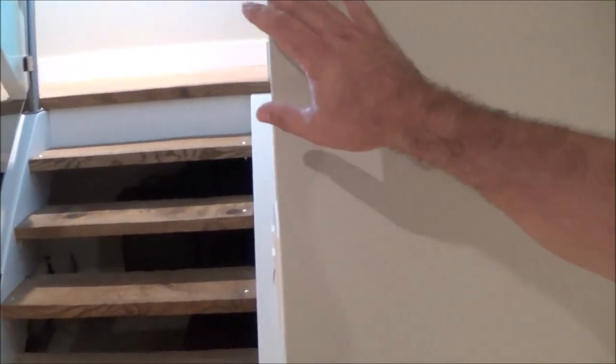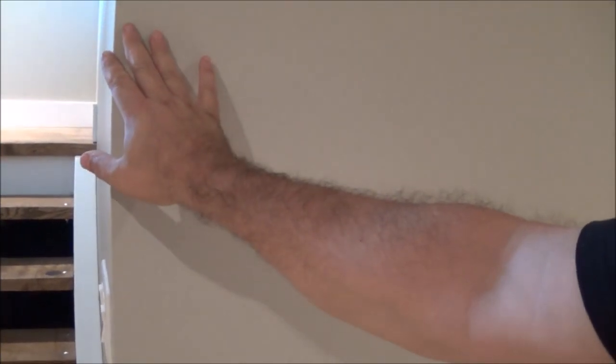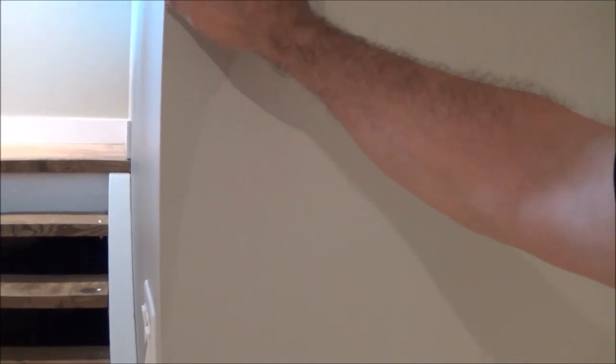Because I'm coming off of this wall here, I'm going to mark back one half inch from the edge of this wall all the way down, because we need to leave space for the drywall. I'll take all the rest of the lines off of this reference line. I'll mark up the carpet and cut it out, then start laying boards down.